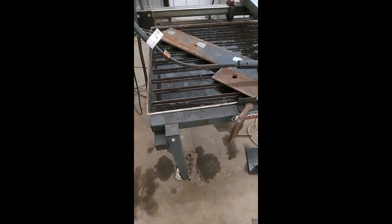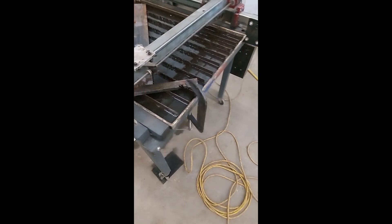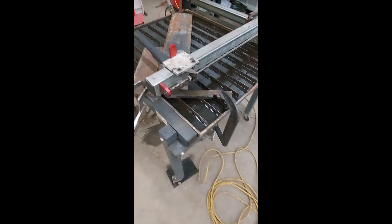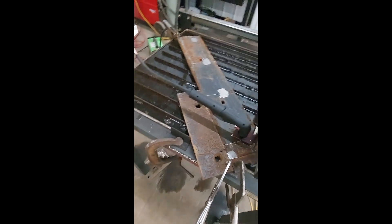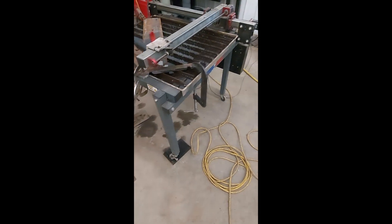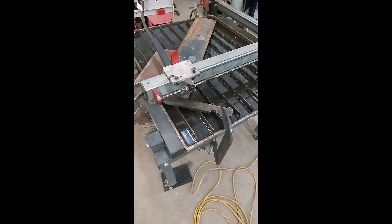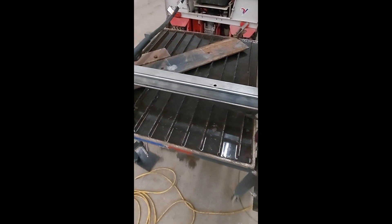It holds tolerances fairly well — it is what it is, a $1,500 plasma table. Great place to start. This one is the two-foot by two-foot version, which I wish was bigger. Getting stuff set up at 45 degrees to make it all fit in one cut can be a little bit of a hassle. There aren't a whole lot of places to clamp to this table or really make a sturdy jig, seeing as the whole water table moves and the supports inside are not held down by anything.